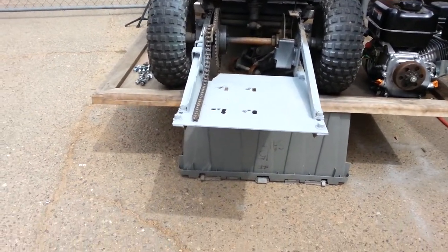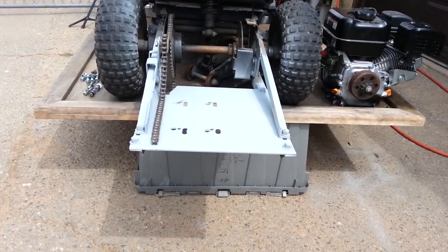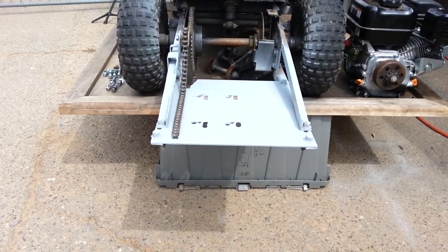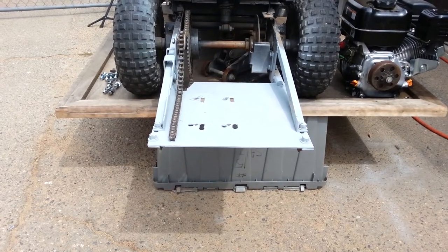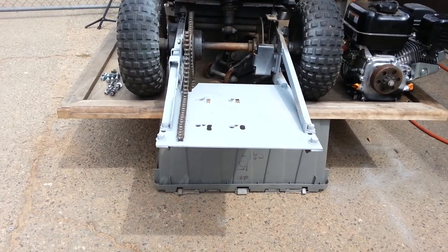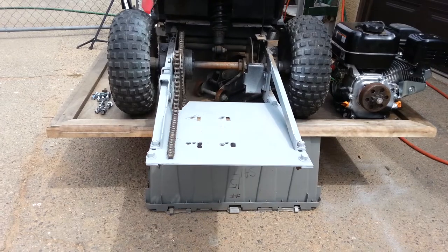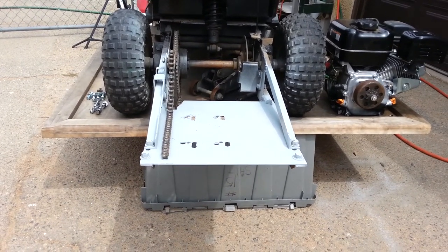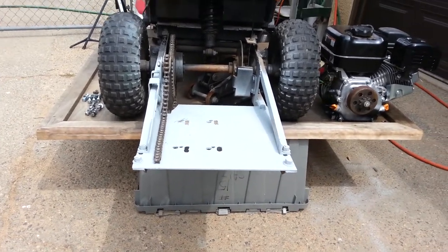So hopefully when I put the motor back on, I'll have to make some new motor mounts. I'm going to raise it up about an inch off the top of that plate and bolt it down to the plate. I'm going to put one inch square tubing to the motor bolted, and then I'm going to drill holes farther on each end so I can mount it to the plate without having to mess with drilling from underneath and guessing and measuring.